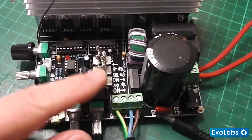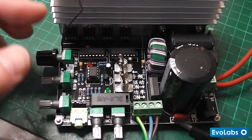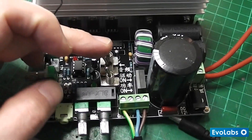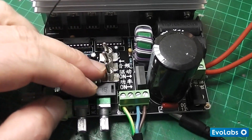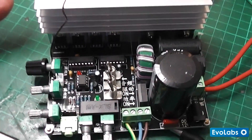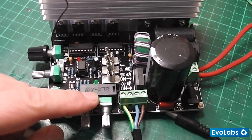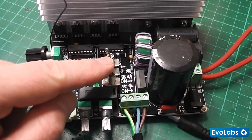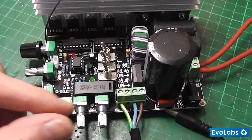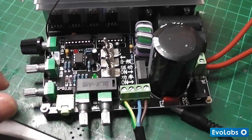These toggle switches are a cheap convenience — the toggle switches have been soldered onto the board, and that's just not going to be practical if you want to encase this in a case, which I'm going to do. So I'm going to buy three switches and replace these with case switches that are external to the board and then run some wires to where these switches were.